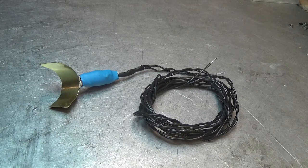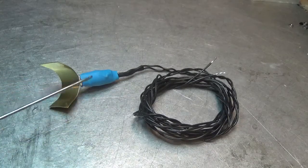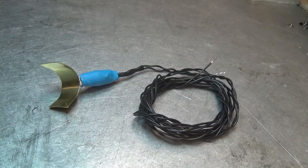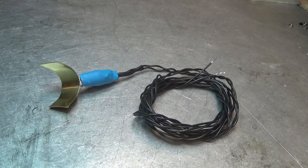If you have a sensor where you measured one side of the wire and it's shorted to the case, you've got a bad sensor. That will keep the controller from working properly. If you get an ohmmeter and you have a short between one of the wires and the brass body, you have a bad sensor — let us know and we'll get you a new sensor out right away.